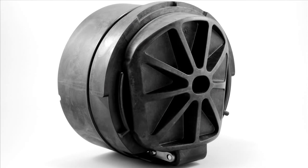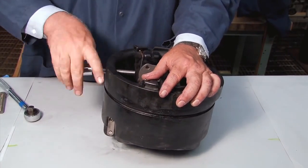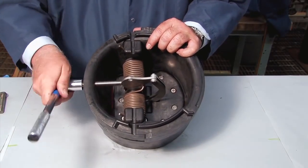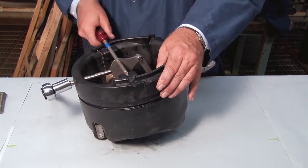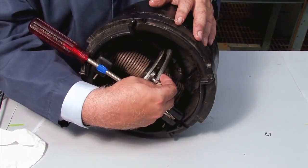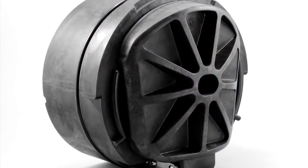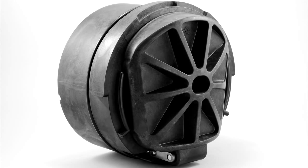The procedure to open the checks found in the 6-inch assemblies varies slightly from that of the smaller sizes. To open the checks, thread a one-half 13x5 hex bolt through the service hole located on the bottom of the check until it makes contact with the linkage. Continue threading the bolt until the hole on the cam aligns with the service notches on either side of the check, and place a number 3 Phillips-head screwdriver through the hole in the cam. Slowly unthread the service bolt to transfer the tension to the screwdriver, then remove the E-clip and pin and inspect the check in accordance with the previous procedure. To reassemble the 6-inch checks, first re-thread the service bolt, replace the E-clip and pin, remove the screwdriver, unthread the service bolt, and prepare the unit for reinstallation.